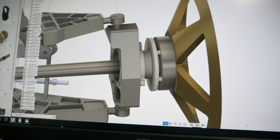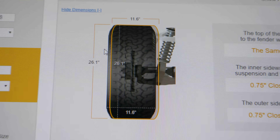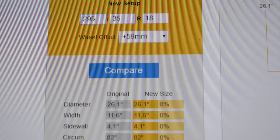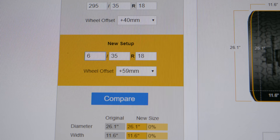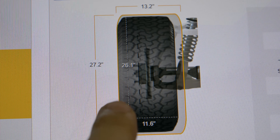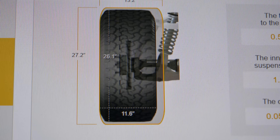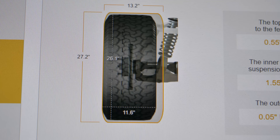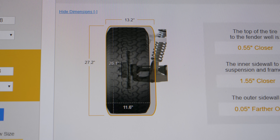So: 10.5 inches, plus 40 offset. They're 295s on 10.5-inch wide wheels, plus 40 offset. This little website is kind of cool. I'm going to plug in, on purpose, the replacement tire size for a ZR1 Corvette — this is a C6 ZR1. They run a 12-inch rim but it's a 335 tire, plus 59 offset. Look at that — they're the exact same outer width. Do you know what that means? This is hilarious, absolutely mind-blowing me — I've reverse-engineered all of the Hoonicorn's work. I've worked backwards to figure out the exact width of the car, which is 78 inches wide. But they shoved the rest of the additional width in the tire for the Corvette inside the car. So I am literally reverse-engineering the Corvette to make the Hoonicorn suspension to make my four-rotor.